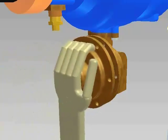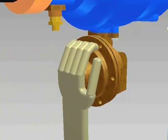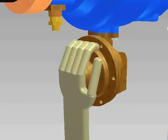Place the cover onto the cartridge assembly and push the cover towards the body. Make sure the cartridge centers into the seat guide ring and the bead of the diaphragm fits into the groove in the relief valve body. Align the hose fitting on the cover to the left of top center.